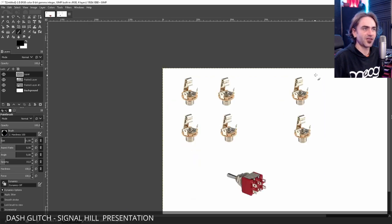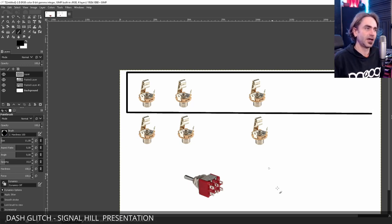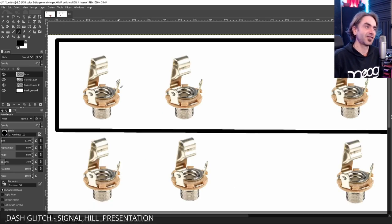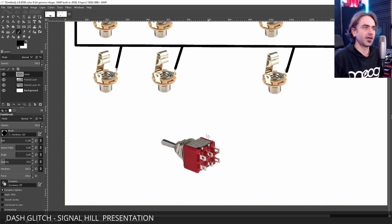Like I said, in my example, not just each switch, the entire circuit has one big common ground. Let's say I've got this big metal connector coming in here and coming in here, so this goes onto all of the other switches. You don't actually have to connect ground to the switches themselves, I don't think. Maybe you do electronically. Maybe it would sort out that little click that I have. Somebody let me know who knows a little bit more about electronics, but I believe this is the correct way to do it. So then all of these ground connectors, let's just connect directly to the common ground. Nice and simple. So how do we connect this to the actual switch?